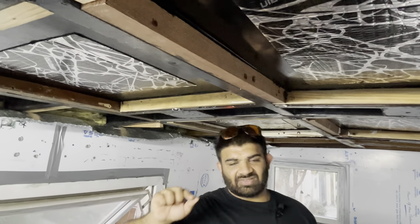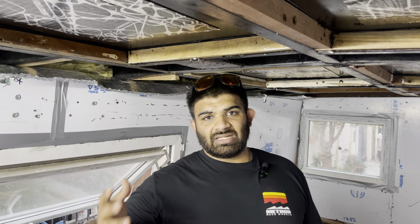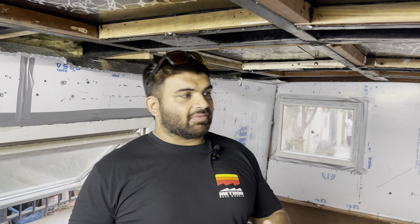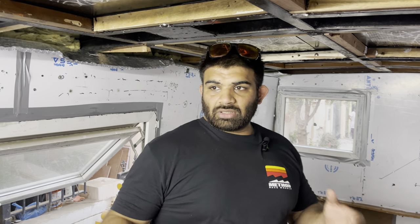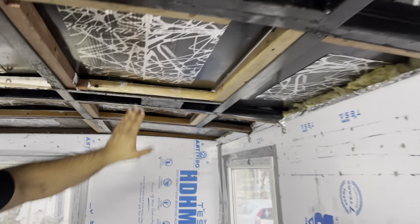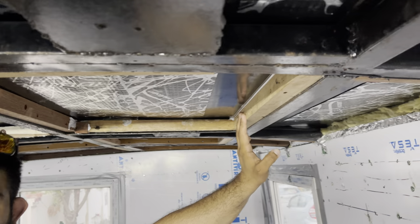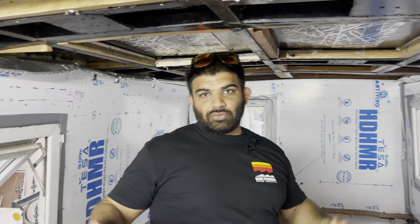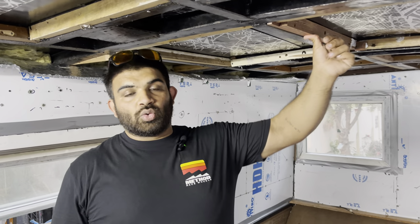The entire frame was initially metal — thin MS sheets around 16 gauge, a mix of 16, 14 and 12 gauge. What came from the army was 16 gauge. We added a lot of 12 gauge and 10 gauge in places where we needed reinforcement. The woodworking team added wood in a lot of places. These are not support beams — this is nice old dried wood taken from old door frames and window frames from our house and friends' houses. Everybody has contributed and donated into this thing.